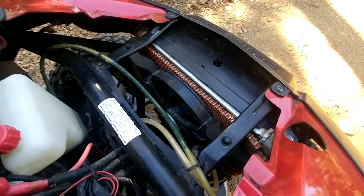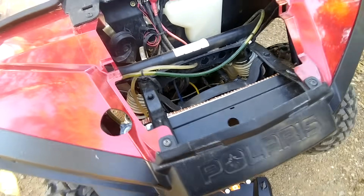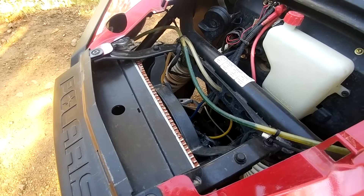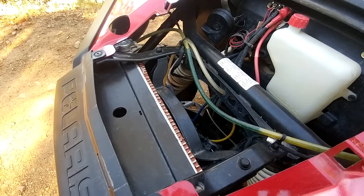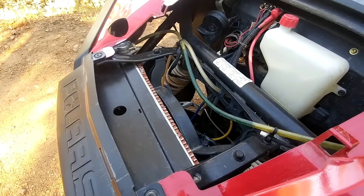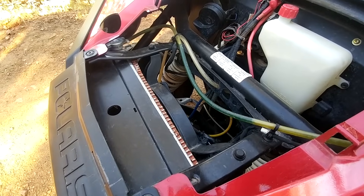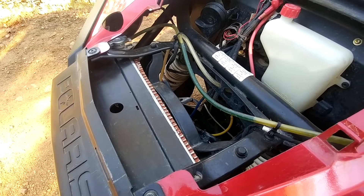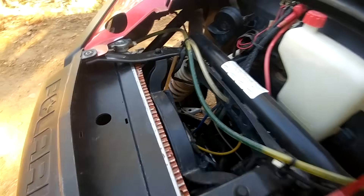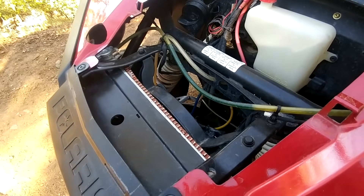I did have a subsequent problem with the cooling system. It's a pressurized system, and it turned out the radiator cap failed, so the machine began overheating — pretty significantly. It's an aluminum engine. I've had race cars with aluminum engines where the cylinder head warped instantly upon overheating. This machine has two levels of ECU protection: a limp mode at around 235°F, and a shut-off mode at around 250°F that just shuts the engine off.